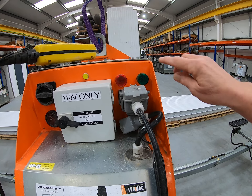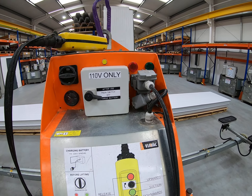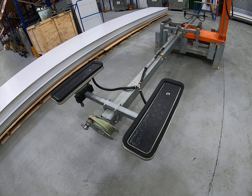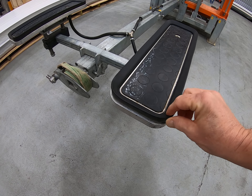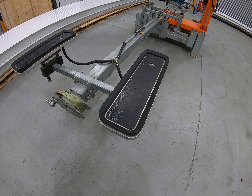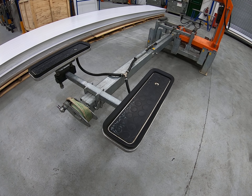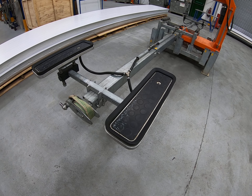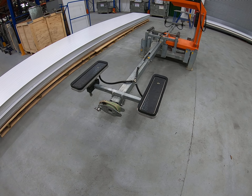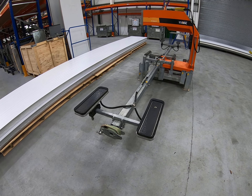Up on top you've also got a green and a red indicator light which will come into their own shortly, and there's also an audible warning. Now a quick word about the suction pads: for most of the suction pads that come to site with our machines, the seals are interchangeable — the seal sits in a compression groove around the aluminium pad. The machine will come to site with a set of spare seals; the only exception would be the pads used for Stedman panels, which are a factory fit. There are separate videos explaining how to change those seals, but if you look after the seals, make sure they don't touch anything apart from the panel surface, and start the machine with the pads off the ground, you should not need to change those seals at all.